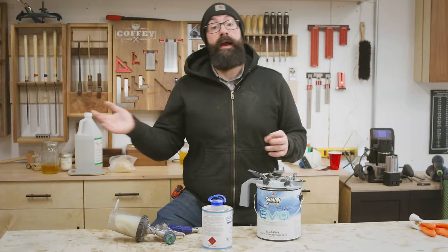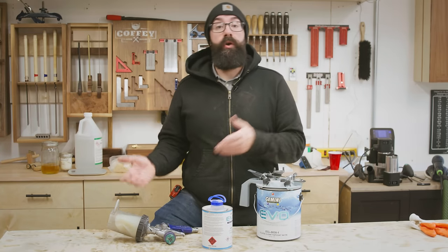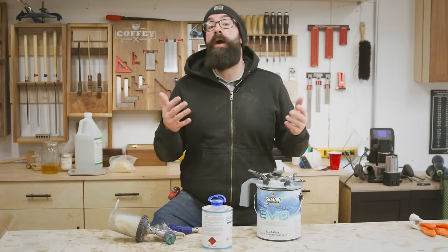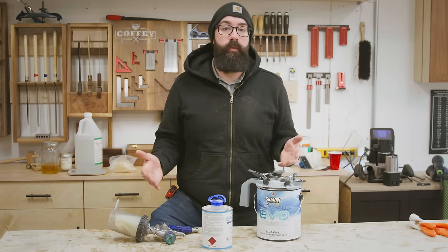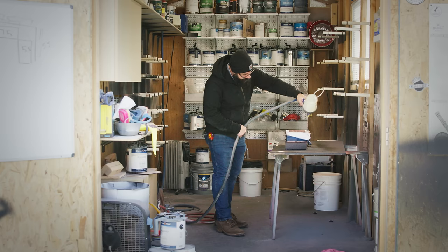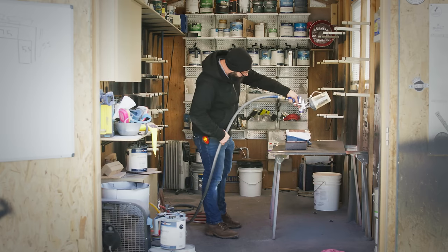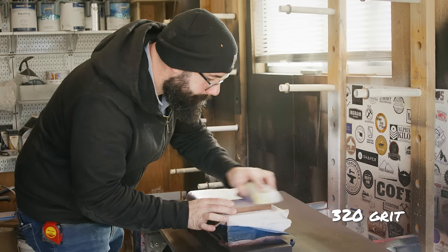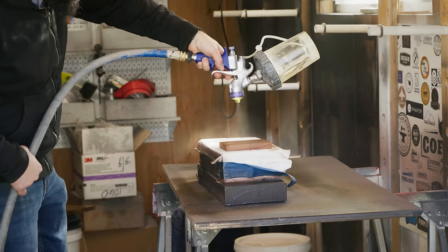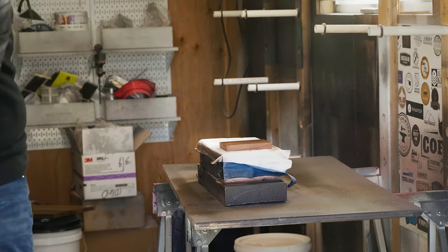The other thing is that this stuff is nasty — really nasty. Once you start adding the hardener, you're dealing with really caustic chemicals that can seriously harm your body with long-term exposure. In my shop we use an HVLP to apply film finishes — you can use an HVLP or an air compressor system, but to use these more professional or industrial finishes you're going to have to invest in spraying equipment and it's not going to be cheap. Application sounds intimidating but once you do it a couple times it's natural: sand your wood to 180 grit going 80, 120, 180, lay down your first coat, let it flash off, sand back almost to the wood with 320 grit, then do your second coat and if needed a third — always sanding at 320 between coats.